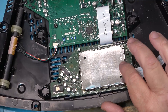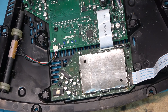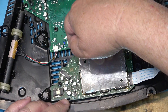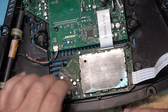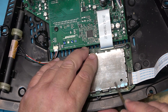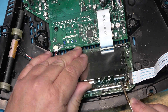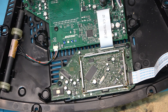You notice the sign stamped into the shield — it says 'do not reuse.' That little IC in the bottom left corner gets hot as fire. Is there anything under here? Let's just pop this top off and see if there are any caps under here as well. I see there are a few here, but are there others? Yes, there are more in here, so let's get the ESR meter out and see which ones are in the worst shape.